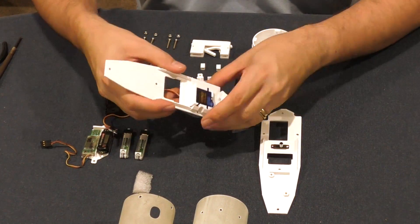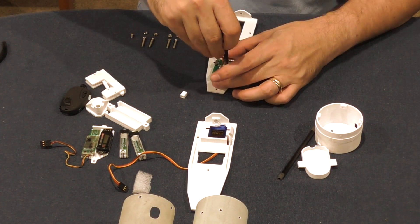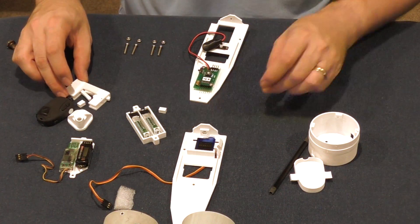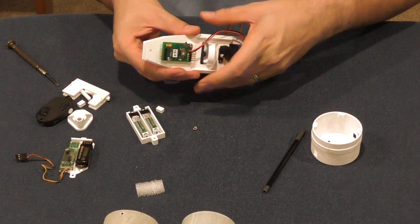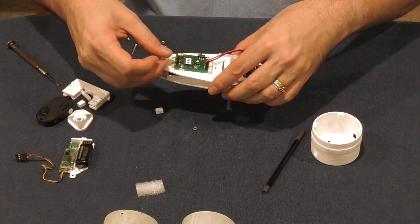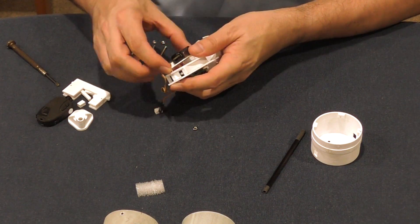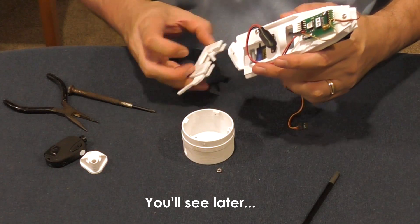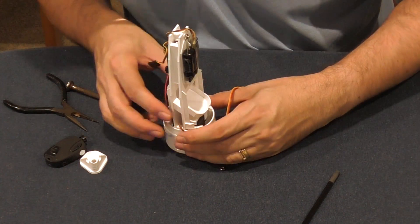We start with one of the side panels and press the motor into it — no screws are necessary for this. Then we attach the servo timer to the other side panel. Next we put the batteries inside a sled; we can change the sled depending on the type of batteries we want to use. Then we insert the camera bracket between the side panels — this just snaps in without screws. Then we insert the battery sled between the side panels and screw it down with a couple of screws which holds everything together. Before we put the nuts on, we add the altimeter sled to the same screws and screw everything together — the sled can be changed depending on the altimeter we're using. The entire top section is held together with only two screws. Next we attach the retention lever sub-assembly, which just fits in between the two side panels. The whole mechanism is then screwed into the cup.